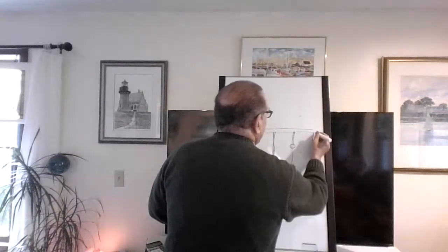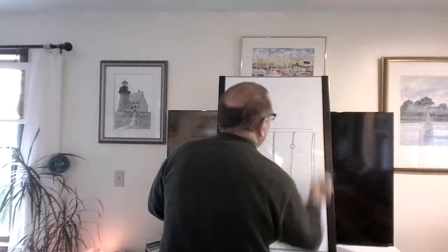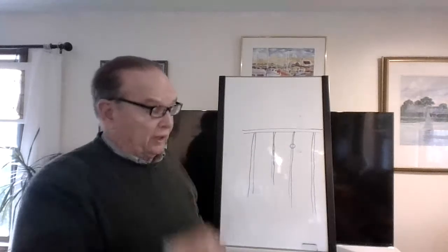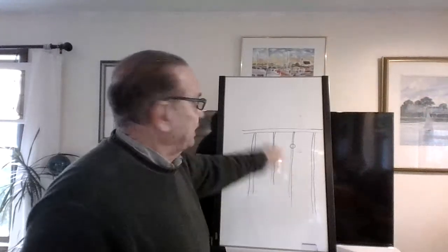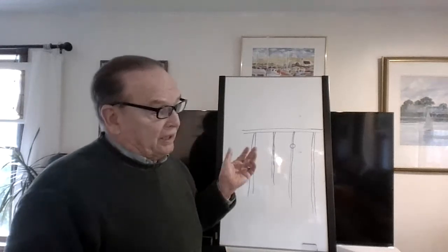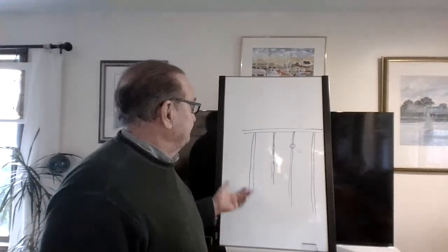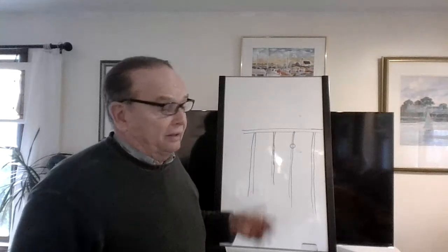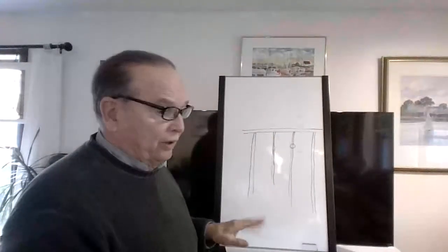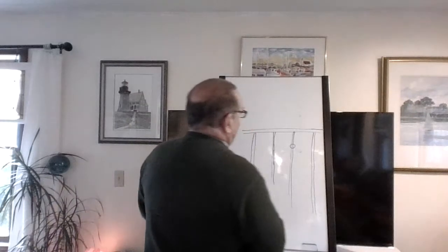If you're working for yourself, it's your business. What I suggest you do is go locate the carpenter or call him and tell him, I'm hitting a floor joist for the water closet. What do you want to do? Once in a while, they'll tell you, just cut it right out. I don't agree with that at all. But if he says to cut it out and he'll box it in later, okay. Then you just take your Sawzall and cut that right out. Now, it's going to be hanging on the plywood floor, so don't worry about it. It's not going anywhere. And then you just do your business.